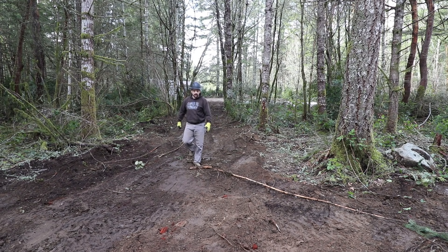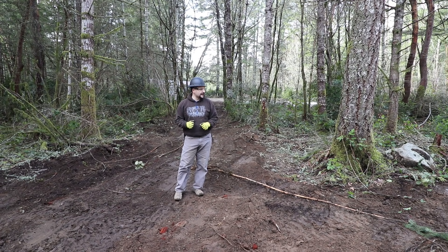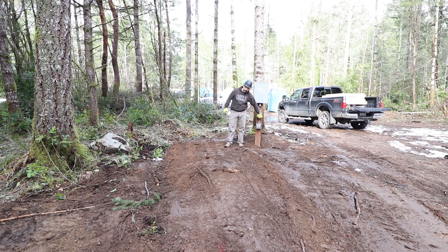We're wrapping this one up. We did all the backfill, got all the wire covered up, had the caution tape in the ground. Backfill had to be complete in order to get the power company to come out and do the final hookup. We have the temporary power pole — for the contractor we're using to build this house, it has to be within 100 feet of the house; this is about 35 to 40 feet. Make sure you have plenty of outlets — there are eight outlets on here on two separate breakers. There are lots of other good videos out there on how to put one of these together technically. Just make sure you follow your L&I requirements and your local power district.